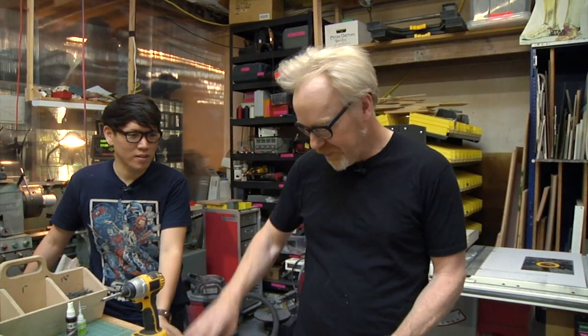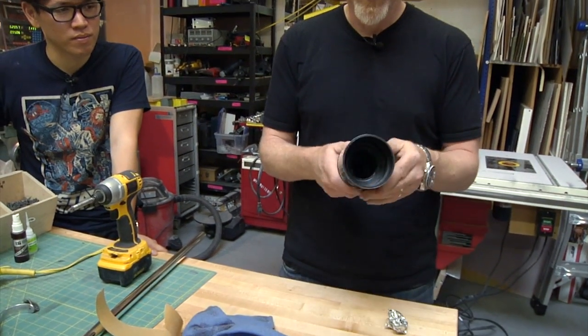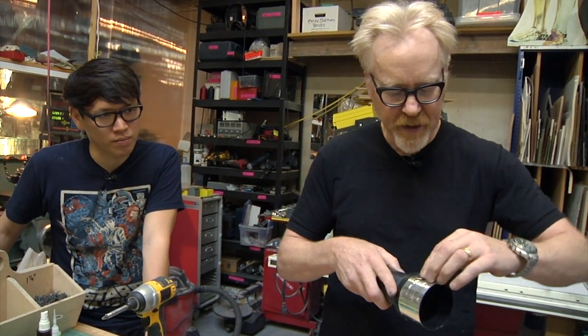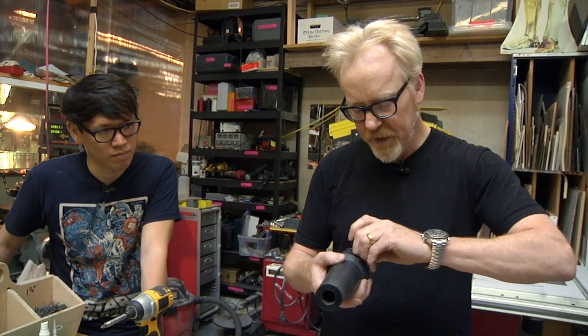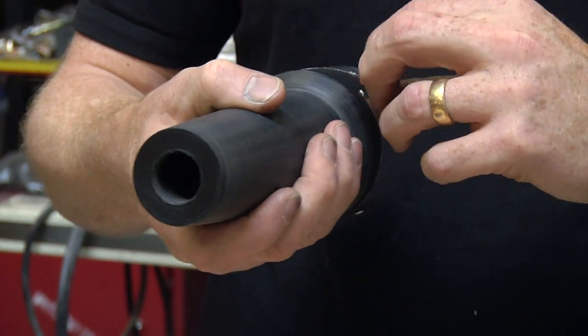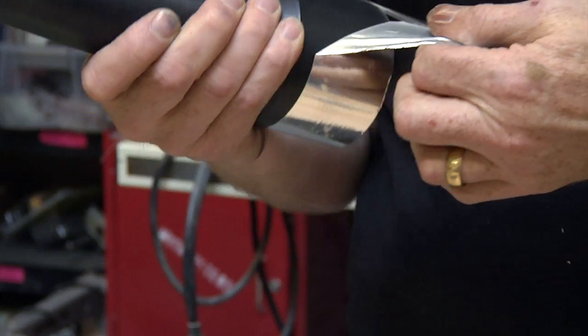The problem is my tape isn't gonna cover the long cone of this barrel really well. It's gonna end up looking sort of chock-a-block because I'm gonna have to cover it in a bunch of pieces. So I've got some primer and some nice chrome paint. I'm gonna try that instead. This acetal should take the paint quite nicely. It's not like Teflon where it's gonna let it go. All right, so let's take this off.